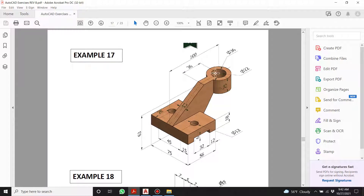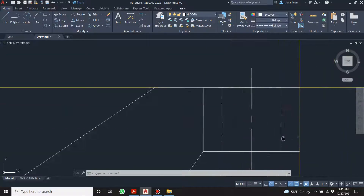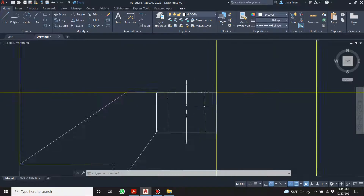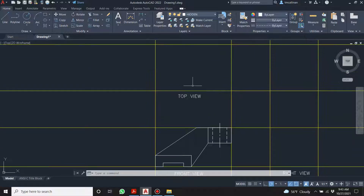From this image, we can assume this hole goes all the way through the object. If it didn't, there would be a note saying the depth is 10 or something. What these hidden lines are indicating to the viewer is that whatever is cutting through this object goes all the way through. That's why those hidden lines are important.